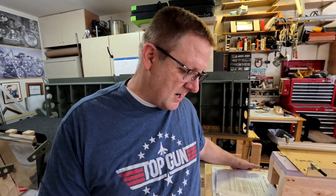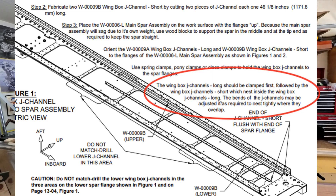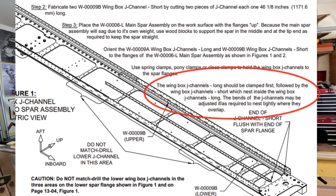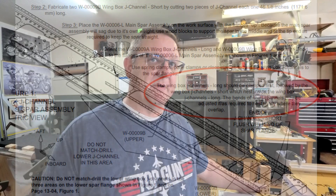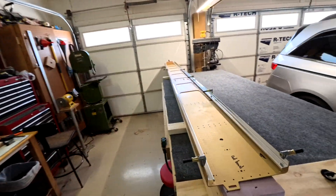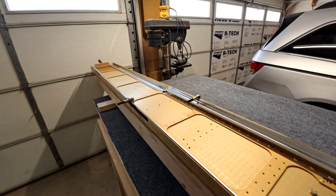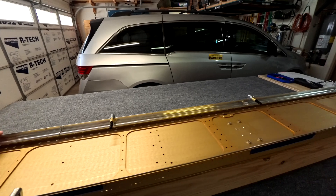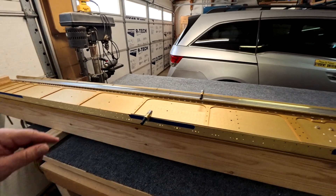The instructions say the wing box J-channel long should be clamped first, followed by the wing box J-channel short, which nests inside the wing box J-channel long. The bends of the J-channel may be adjusted as required to nest tightly where they overlap. So the J-channels are going to overlap. It says to attach the long first and then the short on top of it, but then it has that statement that says it nests inside the long.